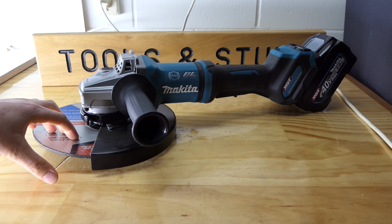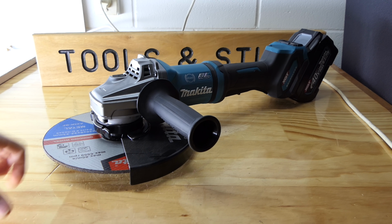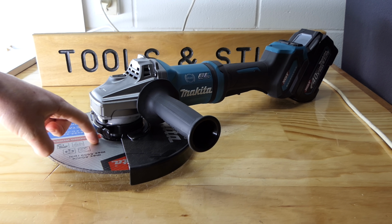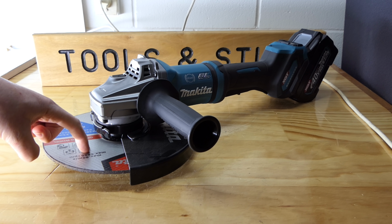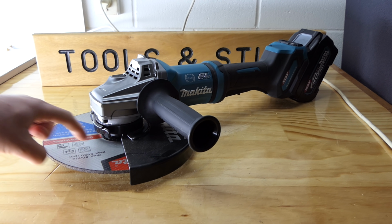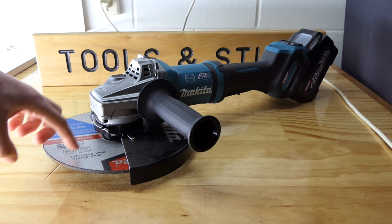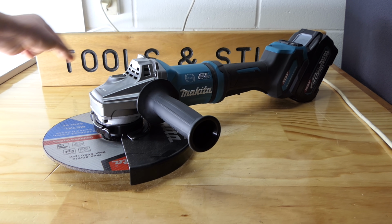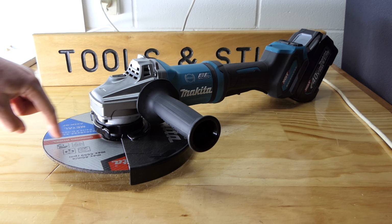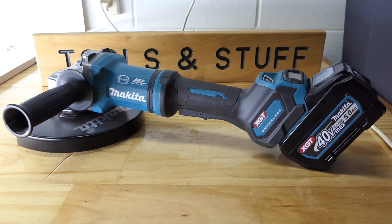And the speed doesn't change when the disc changes size, which is something I know a lot of people have trouble with, but it's 6,600 RPM no matter how big your disc is. So if it's at the full depth here, 6,600 RPM, once it's worn down to here, it's still 6,600 RPM. Any particular point on this disc takes the same length of time to do one rotation. It's just that the further out it is, the higher the speed it does that rotation at. The RPM isn't the speed. This number here is the speed, 80 meters per second. So the outside moves faster, but takes the same length of time to get back to there as that point there. Comprende? Anyway, we're getting ahead of ourselves because we haven't even looked at the specs of the tool.